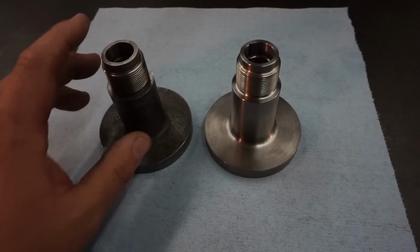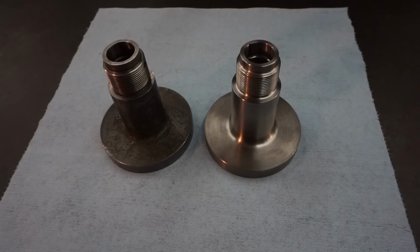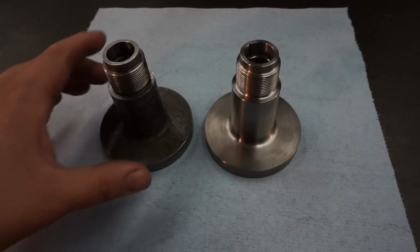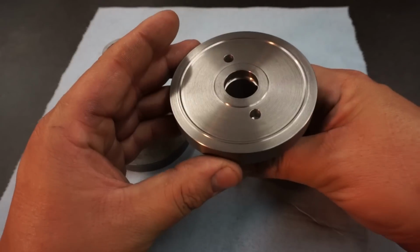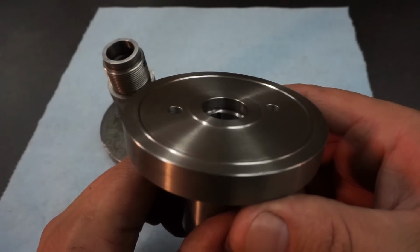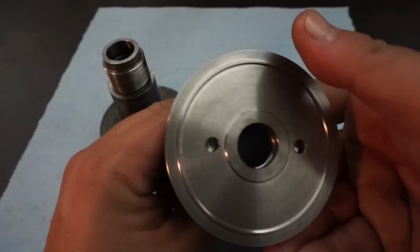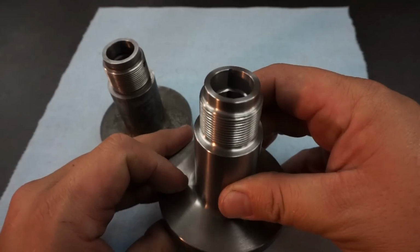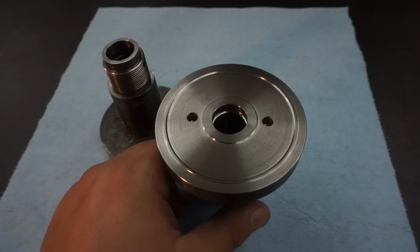And that's what this was all about, was to help somebody out and provide some good quality YouTube content and show some different aspects of machining. That's one of the things that I always try to do, is show different things. And I really enjoyed it. I will point out one minor detail that I did not mention when I was drilling the holes, is that I tried to clock the holes 90 degrees in relation to the oil grooves there, just to make it a little bit more symmetrical there.